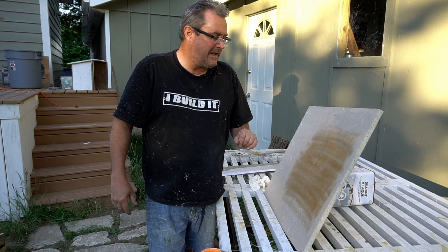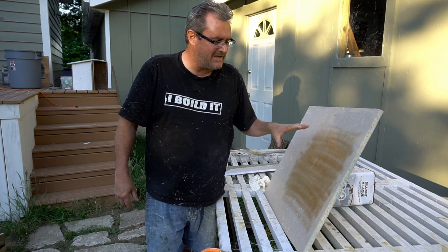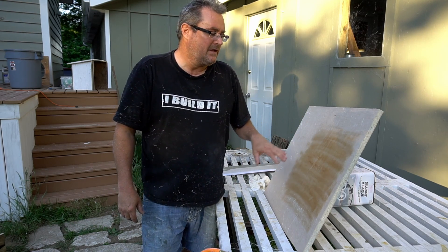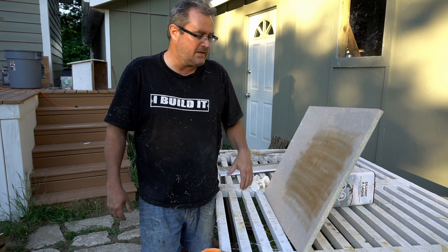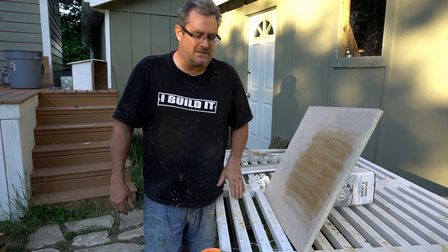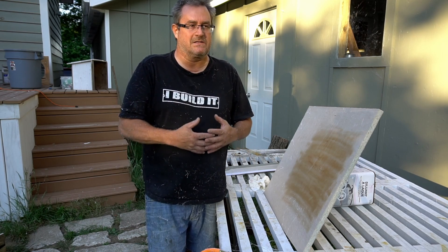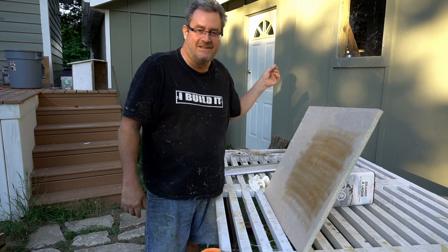I think it'll be okay if you brushed it on, let it dry, sanded it, and then gave it another coat. What I said in the beginning was that it wasn't a very high-grade finish — anyway, it was just something really from nothing. You take the styrofoam, you dissolve it in lacquer thinner. In my case I used lacquer thinner that was used — stuff I was cleaning blades with, already contaminated — so that's a good use for it. I've tried gasoline. A lot of guys suggested gasoline as a cheaper alternative. Gasoline doesn't melt it as aggressively, but it still does melt it. Just for the sake of the video I used lacquer thinner because it looked more dramatic. Anyway, that's it for this one. I hope you enjoyed it, see you next time.